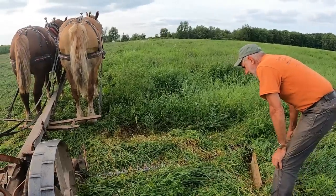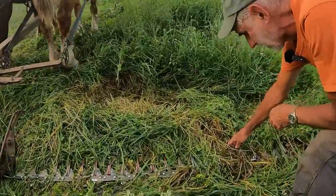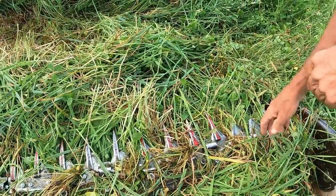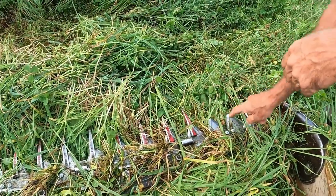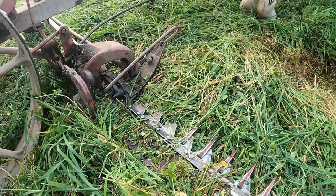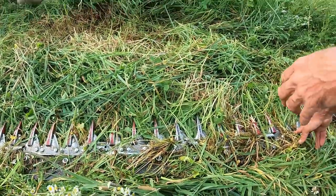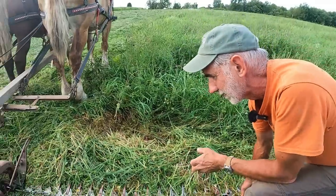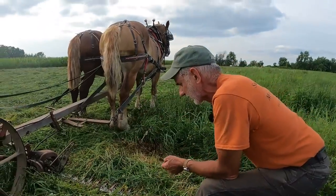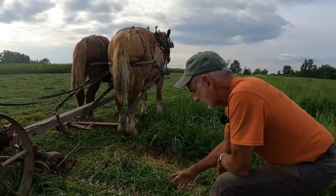My biggest problem I'm having is it balling up on the end of the guards. So I'm trying a few more things. I've got some stub guards right here, and on the inner, by the inner shoe, there's stub guards there, and that's working pretty good. The other day I actually tried something that I've never seen before or heard of anyone do, but I actually put stub guards the whole way on my cutter bars, and it didn't work good at all. It worked terrible. So I went and put my regular guards back on,